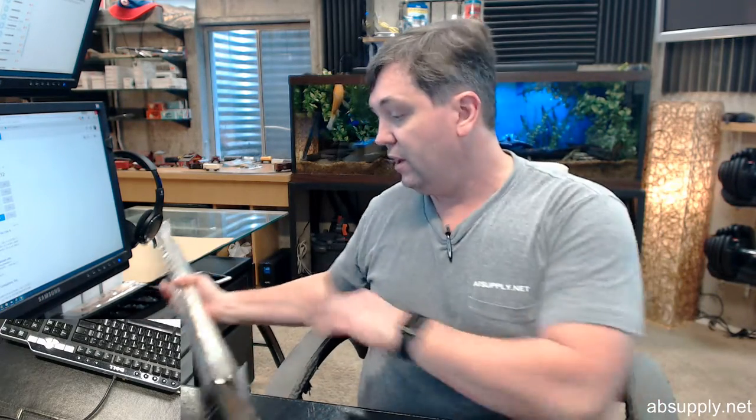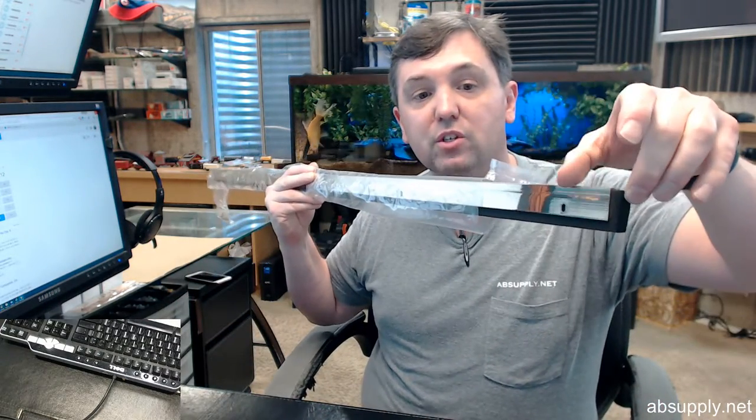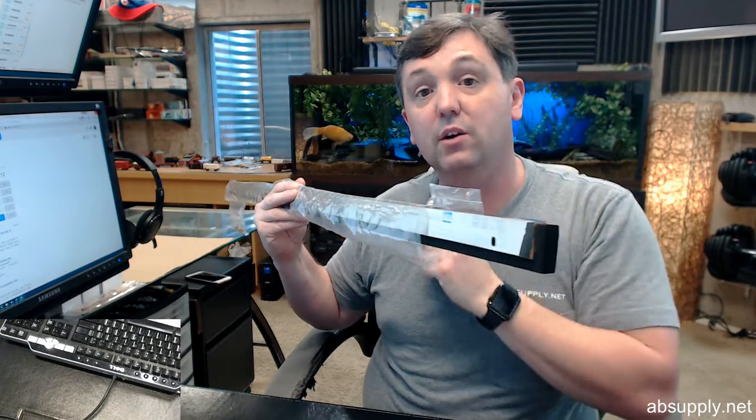So if you want to order a net length to all of these pieces, just order the next longest piece or pieces, indicate in the comment field the length that you want us to send the material out at, and that's how it'll come out. And then the advantage is you'll have holes at the proper distance from the edge, and of course the proper center to center as well.